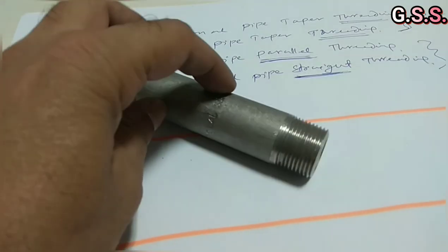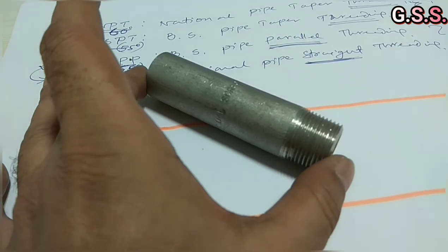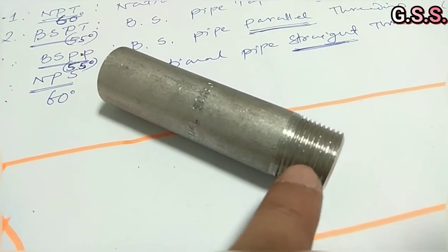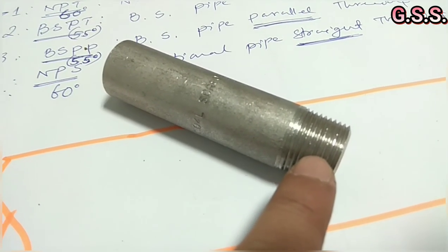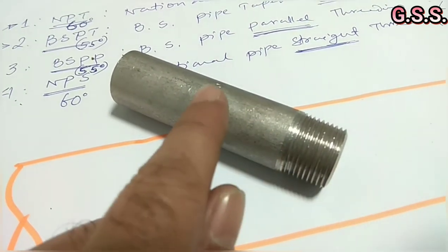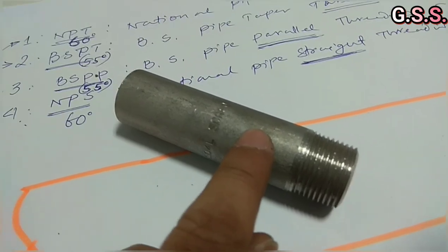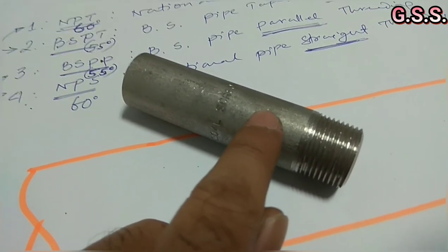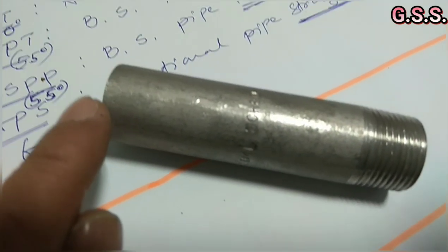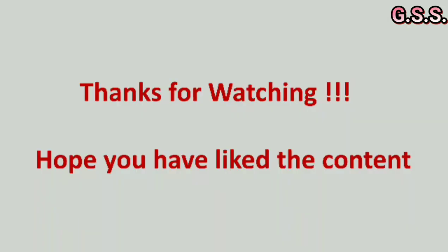For purchasing any nipple, we have to mention the overall length — maybe 100 mm or 150 mm — and the type of threading at the end, maybe NPT or BSPT. In the case of a threaded nipple, normally the schedule of the nipple is one schedule higher than the pipe. If the pipe is half-inch schedule 40S, then the nipple thickness should be half-inch schedule 80S. The other end should be specified as required — maybe plain end or butt weld end.